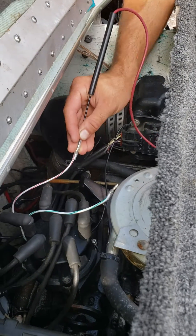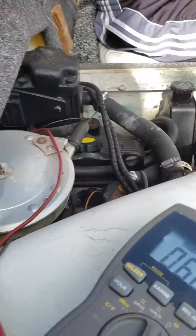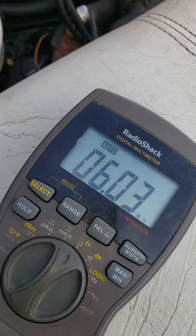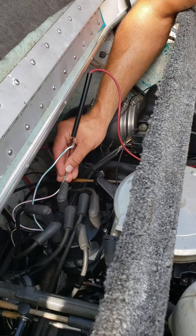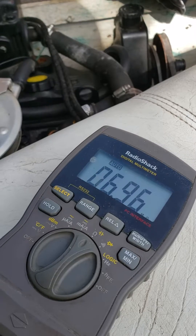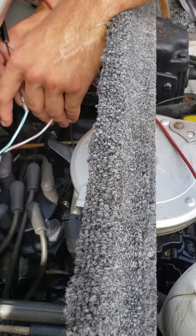So now we're testing the new part, and we have it already installed, but we're making the video after the fact. You do not need to have it hooked up. We just took the black negative and the red wire. We're measuring the resistance on that — six megs. So on the broken one it wasn't six megs, it was infinity.